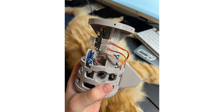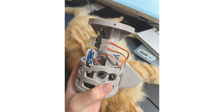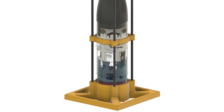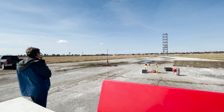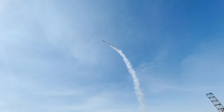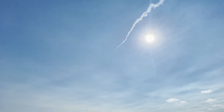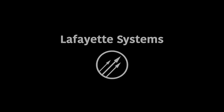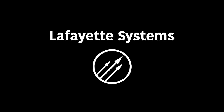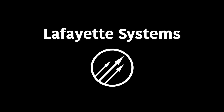What's coming up next? I have more powerful H42 motors I can fly on, and I'm looking to shave weight off the vehicle. I'll remove the mid-body wings for the next flight and replace a lot of non-load-bearing steel screws with nylon ones, saving maybe 80 grams. Combining those two measures should increase rail exit velocity by about 40%. I'll also make edits to the flight control code and hopefully test roll control soon. Roll control worked okay on previous canard-control rockets, but roll reversal was a problem — hopefully aft fin control can solve that. Thanks for watching; stay tuned for next time.